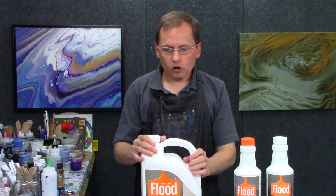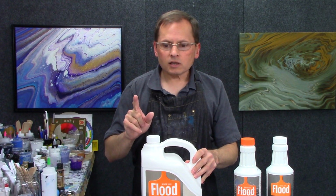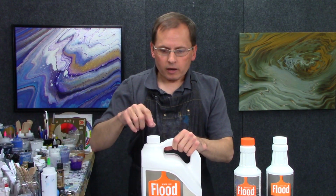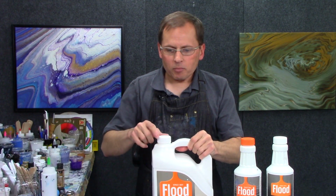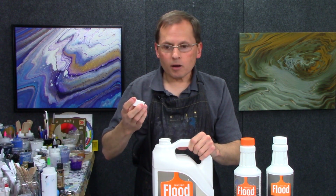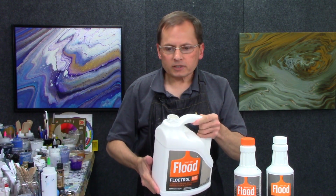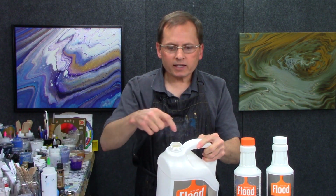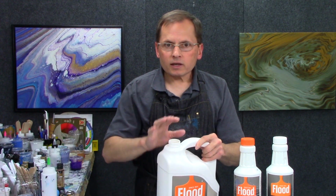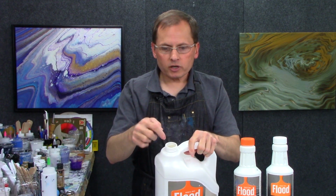A couple of the things to look out for with Floetrol, and these are kind of the problems with Floetrol. There's not too many of them, but I want to let you know about them. The first thing is you can get some bad bottles. Now, when I go buy my Floetrol, this is a brand new gallon. I will always, in the store, open these up and take a look inside. There's no protective seal or anything like that, but take a look in there. And if there happens to be any gritty, sandy looking debris or residue around the opening, then avoid that bottle. I've bought them before, and they've had that gritty, sandy looking residue.